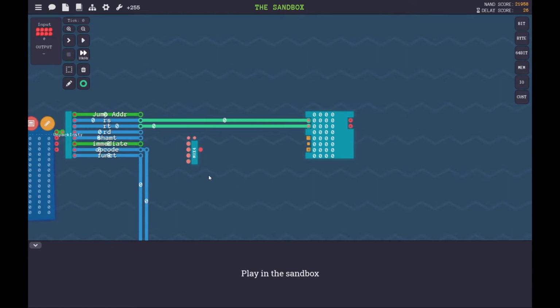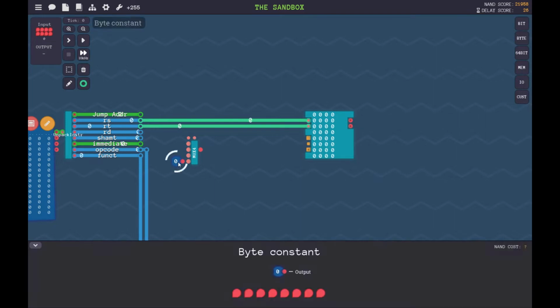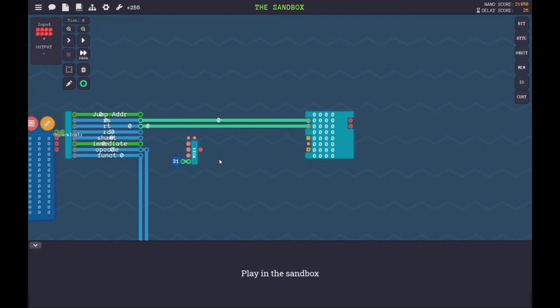They're how you do function calls. But they have a side effect of adding another way that you can cause a write to the register file, and I will talk a little bit more later about exactly what's going on when we wire it up. But the important thing to note is that it can force the target register to be register 31. So there we go. And this controls the write address over there. And we'll worry about the enable and data pins later.